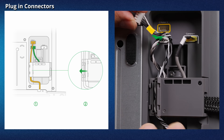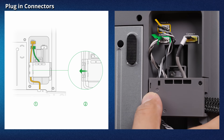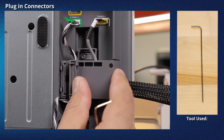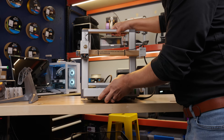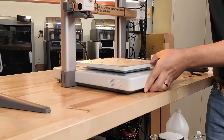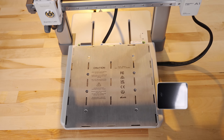The cable box has a cover slot to keep the orange cable safe. Insert the cables and close the cover — if the cover is already closed, it can be pried open with the H1.5 key. Carefully pick up the printer and stand it back on the table. The bed can slide around when being rotated, so make sure you hold the base and the frame firmly, protecting the bed as you lift. Turn the screen to the front of the printer so it can face forward.